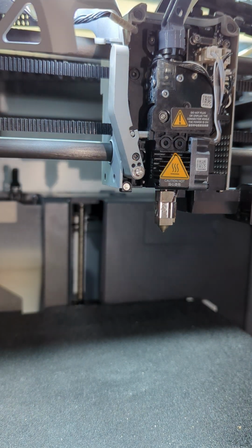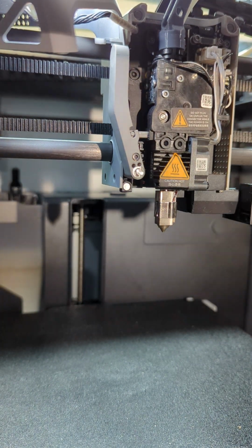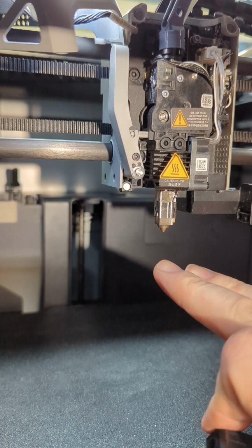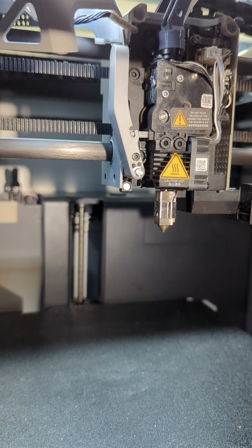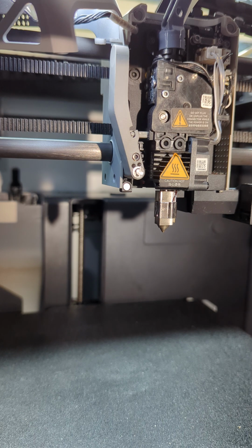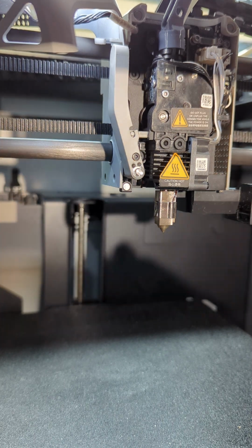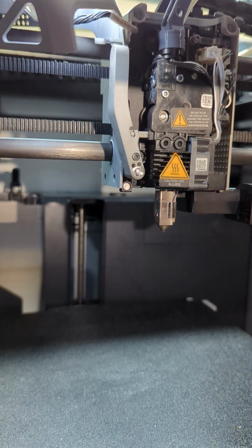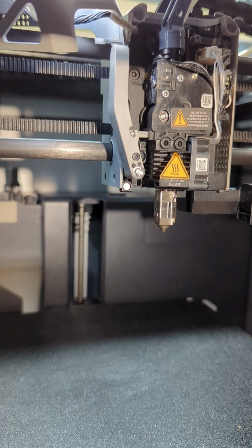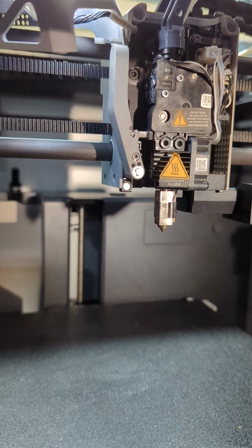What I use, like I said, I use the Slice Engineering plastic repellent paint too, just to make sure that it lasts longer. And I've not had any issues with PETG since then. But you have to wait until it cools down fully before you paint a little bit on there. And then when you go to first print, it will heat up the nozzle and it will actually cure it once it gets to like 100C. So other than that, that's great.